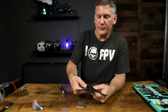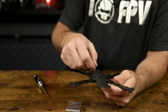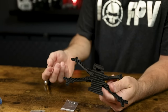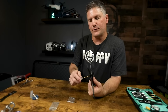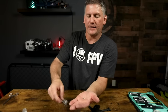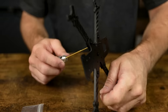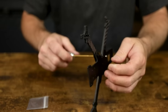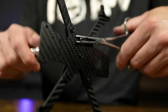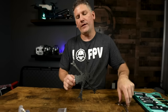Take your 1.5mm hex driver. Use four of these screws for stack mounting — the stack mounts in a diamond configuration. You can also use a 20x20 mount for a custom flight controller, but I recommend using the flight controller I've tested for six or seven months. I like to use nylock nuts on the bottom of the stack to keep the screws from loosening over time. With nylock nuts, the stack screws will not loosen up, and they'll be securely locked to the frame.